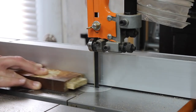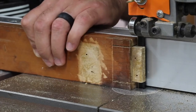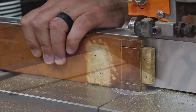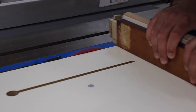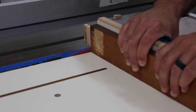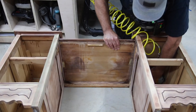I used the fence as I fed the rail into the blade until I reached my mark, and I did this for all four sides. I could have easily cleaned it up at the bandsaw using a miter gauge, but since I already had my sled set up on the table saw, I used that to clean it up and cut the tenon to length.